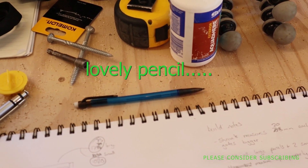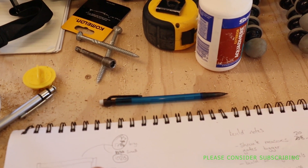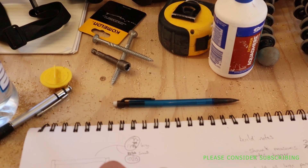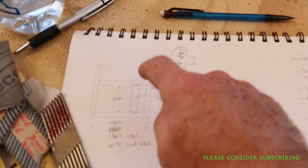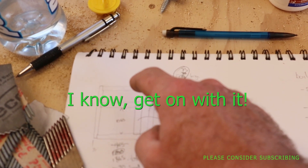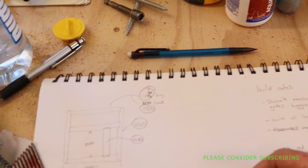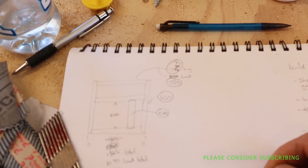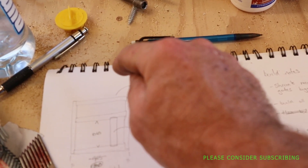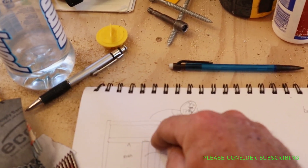We also have here a 10mm notch, because I want these to house in here. It's timber that's exposed to the elements. With timber that's exposed to elements, it's going to twist and it's going to want to move, because it's absorbing and shedding water. Because it's still basically a tree — that's what they do, that is the nature of timber. So if you can house things and fix them off, you're better for it.